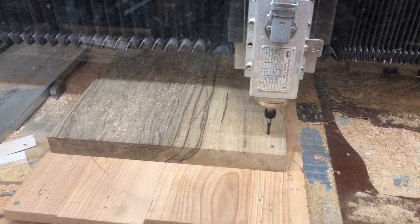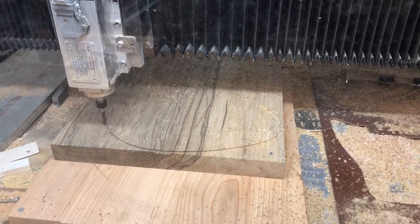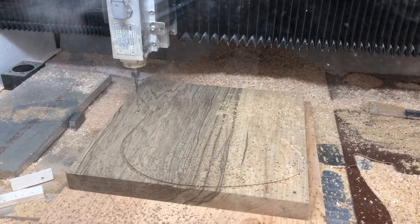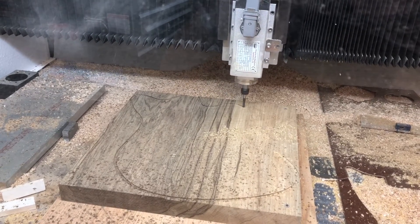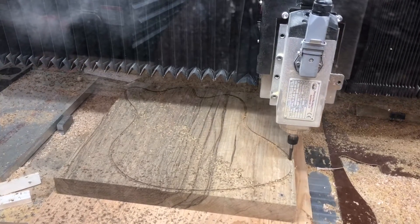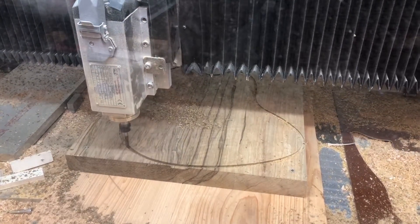Here you can see just nice and slow — I didn't want to take it too fast by any means, because I only had one piece of black limba. I've actually been wanting to do this for about two years; I've had the wood but just haven't had the motivation and I've been a little scared to cut into it. My depth of cut was about a quarter of an inch for my adaptive tool paths, maybe 150 to 200 inches per minute.